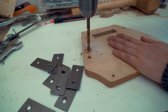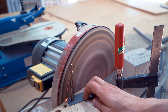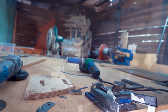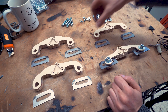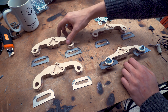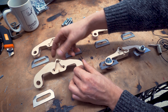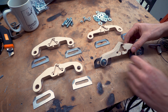To cut a radius in the corner you can use a drill bit, drill a hole, and then use that same drill bit as a pivot point and rotate your work piece around and let the grinder take off the corner. This radius will be concentric to your hole. These are the sound boards for the mechanical rhythm machine. As you see on the top they have a slightly different form and this will actually produce the envelope of the sound — this is for the whole note, this is for the offbeat, this is for the 16th, and this is for the triplet.